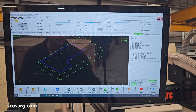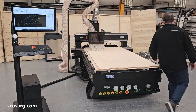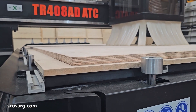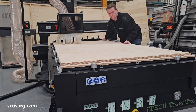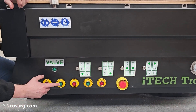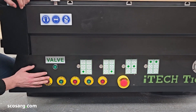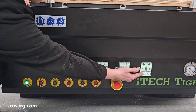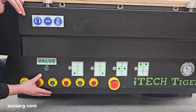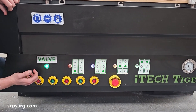I'm going to adjust the position stops upwards so I can position my board, then run the program. Down here is where you can turn on your vacuum pump and your dust extractor. You then have four zones on this machine: the front left and right hand corners, across the middle, and across the back. We'll turn the vacuum pump on, open all of the zones for a full-size sheet, and that will hold down the whole entire sheet.